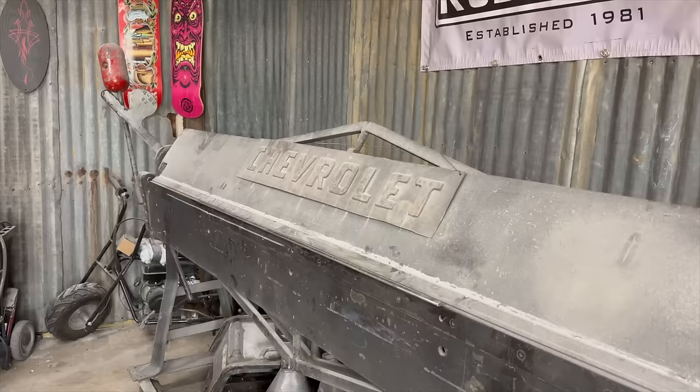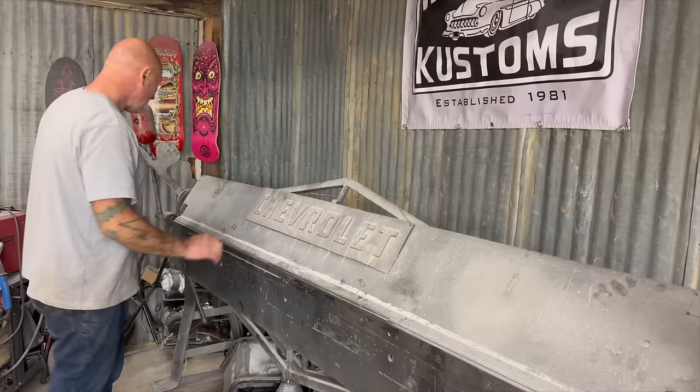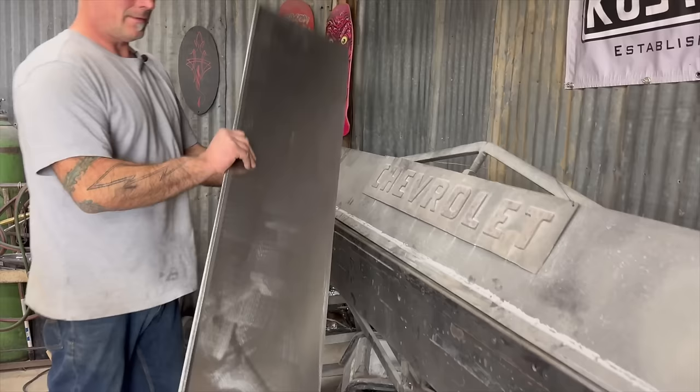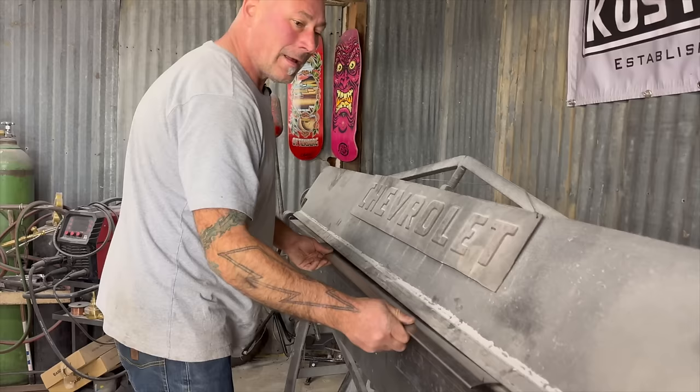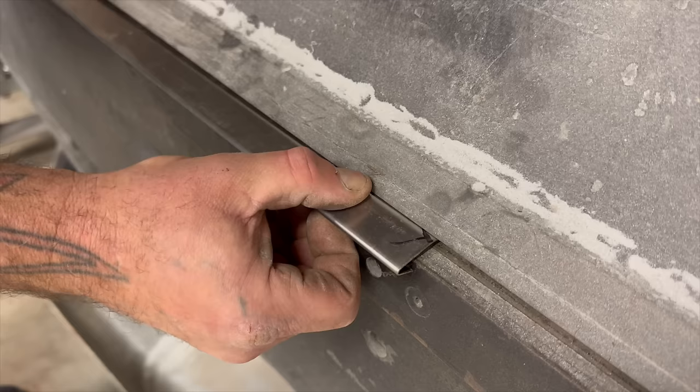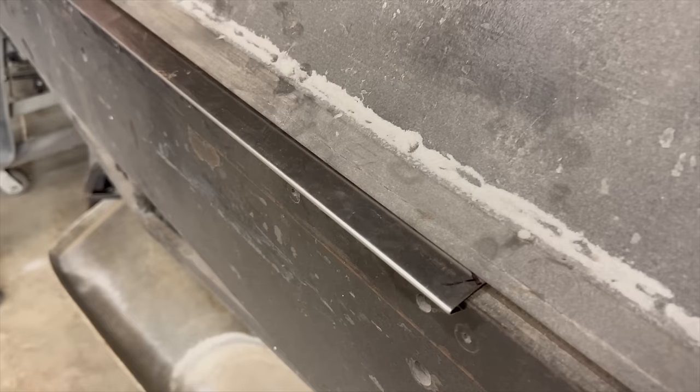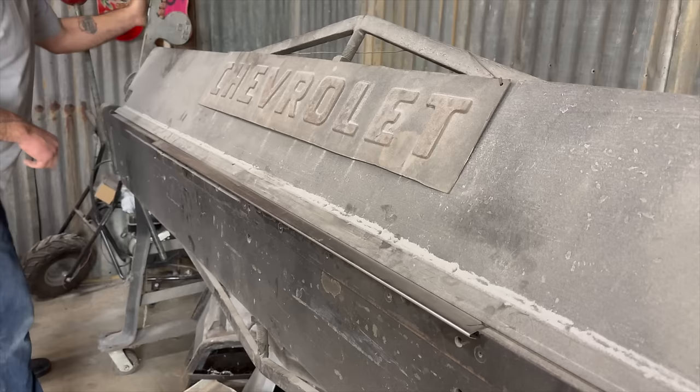I'm going to take this and just hit it — about maybe that much, just enough to put a little line in it. Nice, just a fine line. I'm going to put it back in — see, I flipped it, I bent it this way up. Now I'm going to put it back in and bring it just to the other side. See the mark? That was the mark I made. So we want to have a little bit of a radius bend, so I'm pulling it just to the top side of that mark. I'm going to duplicate that here, just by eyeball — you can look right down and that gap looks even. I'm going to kick it. See, this is bending down a little bit — I want it just about horizontal.